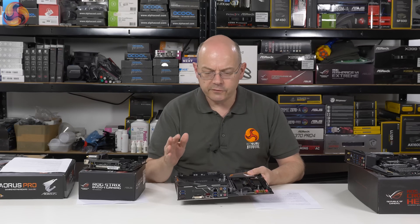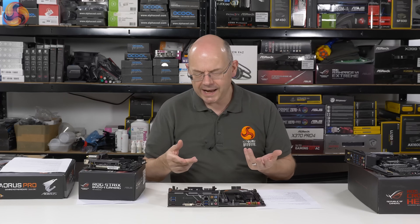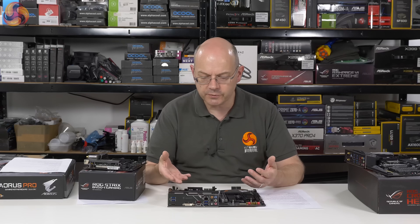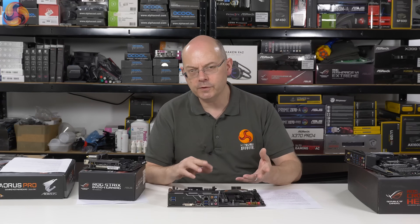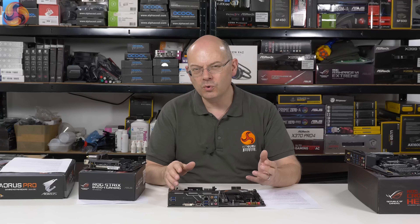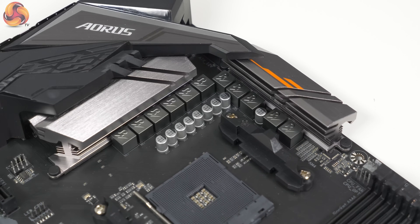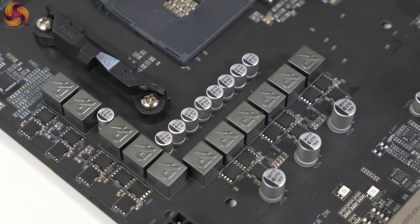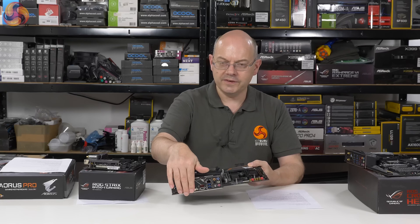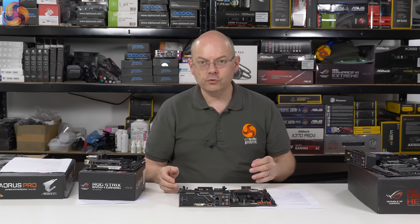This motherboard is not a straight upgrade from a previous model — there was no B350 Aorus Pro — so it's a bit of a mix and match, designed to sit at a certain point in the product stack. This is the board where Gigabyte went to town claiming great things for the VRMs. They've subsequently updated their website; however, the box is printed with eight plus three VRMs — it's not, it's four plus three. Four phases for the CPU could well be adequate if you're not going absolutely mental with overclocking, but it suggests it's more suited to Ryzen 5 rather than heavily overclocked Ryzen 7. The three phases for the SoC and graphics suggest it could support an APU, though with no DisplayPort on the IO that makes very little sense.